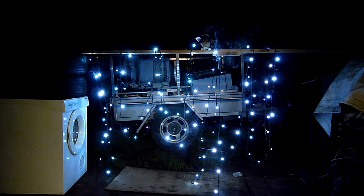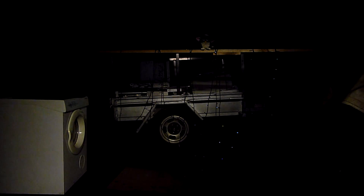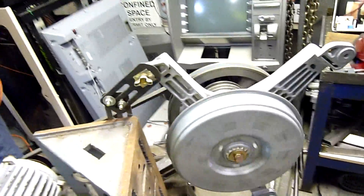Oh, these things are tough. Some of them are hanging in there. I think the drive motor just went short — still going. Oh, that thing's horribly shorted. That's 100 hertz — back it down. It's 150 hertz. Wow, some of them are just hanging in there. These motors are not as punchy as the Fisher & Paykel ones. The Fisher & Paykel ones create devastating arcs when they start breaking down.